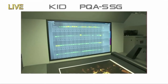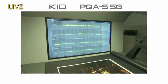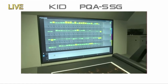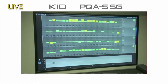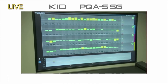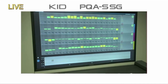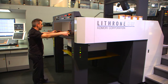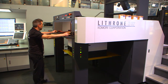The colors are shown on the KID display, and the densities are shown at the top for the keys of the four units — the colors are automatically corrected. The line graphs at the bottom show average density trends, and it looks like they're already okay. We've started our production printing. The combination of the Lithrone G37 with its high basic performance and the systems in place enables the pursuit of high productivity.